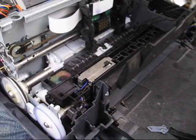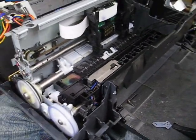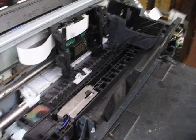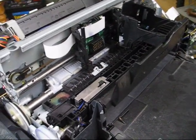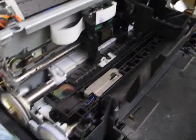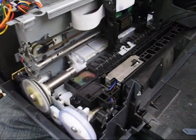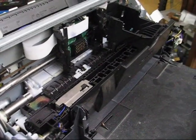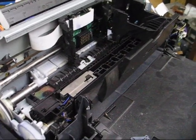The mechanics overall are pretty standard — gears, shafts, paper up, paper down, traversal side to side. Build quality looks pretty good. I suppose I'd be disappointed that it's all plastic construction — not metalized plastic, just plastic plastic. So you see little ground wires and ferrite beads everywhere to keep the EMC okay. It's what you expect — it's going to be cheap for what it is, but also nice. It certainly lasted well over time.